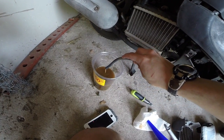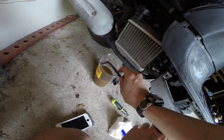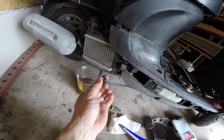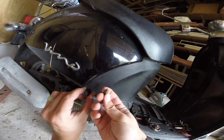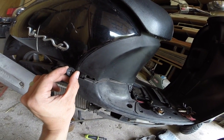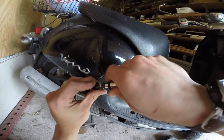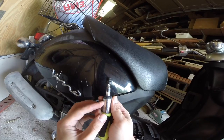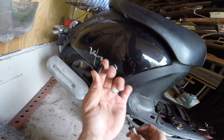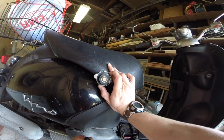You can see how disgusting this stuff is that I got out of the radiator. It's just straight up rust. It looks like they just took tap water and put it in there. Hopefully there's not too much corrosion — we'll have to find out. Here's the plug. I wanted to show it because it's got a really fat Phillips opening. I did not use this one; this one's really thin. It's very important that you use the thickest one. It's very easy to strip this plastic drain plug, and it's got a little rubber covering on there too. Ideally it would be great to replace this. I didn't know I was going to need to do this so I don't even have any of these parts. I'm going to eventually replace it — I'll probably order that this week. But still, you can see all the rust in there. It's disgusting.